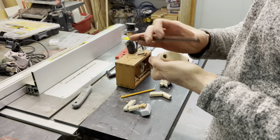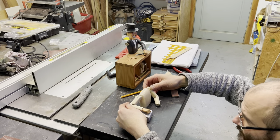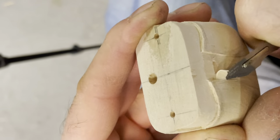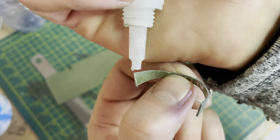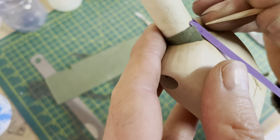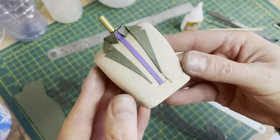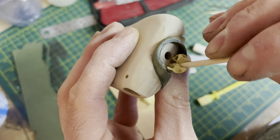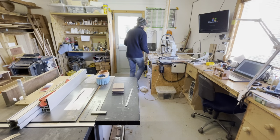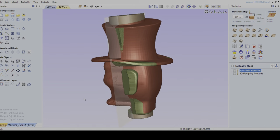I'm now able to carve the basic shape of the Magician using a combination of craft knife and sander. I always regularly assess the shape and form of the sculpture and bring together other parts to make sure they look and feel right. In recent projects I've evolved to add detail rather than carve it out — here I'm using a combination of both. I carve out the bottom of the jacket and the cummerbund, and I've added using thick card the detail of the shirt and the jacket. I've wrapped the collar around the former to create a space for the neck to sit in, and mixed up a small amount of two-part filler to block in the gaps around the collar and fill inside the neck so I can drill out a cleaner hole.